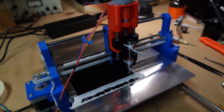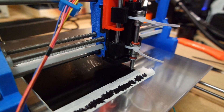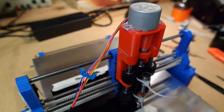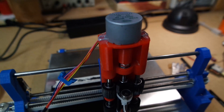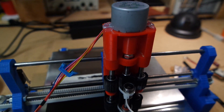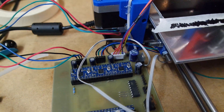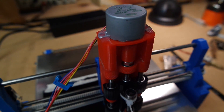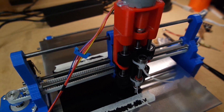Over the past two weeks I've worked on the z-axis tool holder and I'm pretty happy to report that it's working quite well. I added another level to the tool holder itself. I put on a very small stepper, but this stepper actually has some gear reduction, so it works quite well. The only thing I had to do to use this stepper together with the Pololu sticks was to convert it to a bipolar stepper, which can be done fairly easily by just cutting one copper connector on the back of its connection PCB.